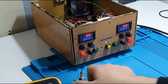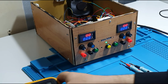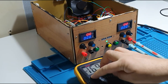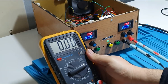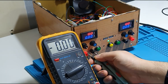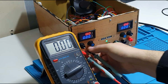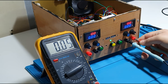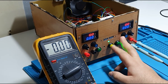To activate the output, double-click the SW0 button. This LED turns on, indicating the output is active — this is the safety feature. When changing voltage with an application connected, you might accidentally switch to 12V and damage it. So always hold the output first, change the voltage, then release. I double-click: the LED turns on, and we now have 8V output. I can adjust with the potentiometer — now showing about 5.6V, 5.87V, 4.7V, 4.8V. The dual multimeters are slightly variable but closely matched.